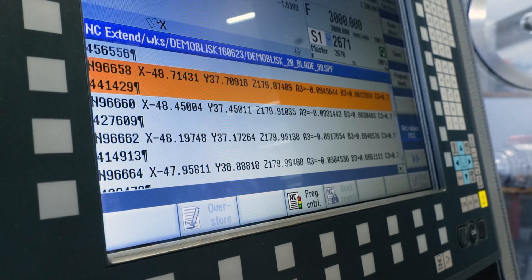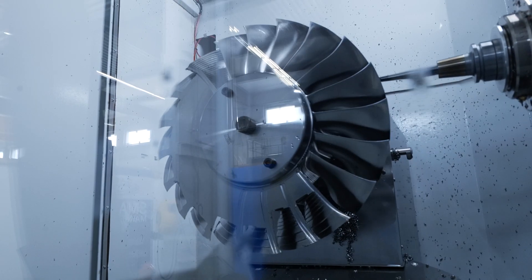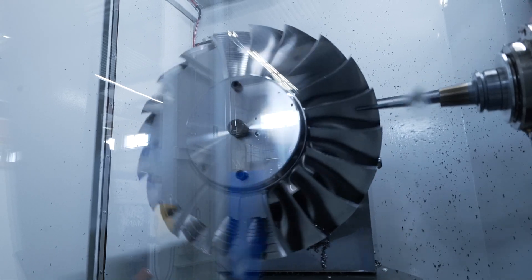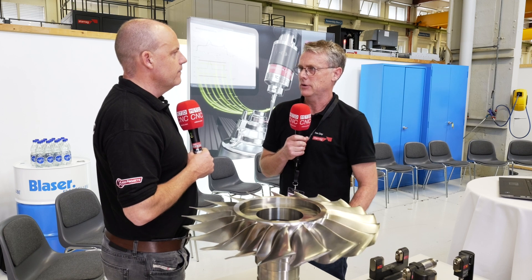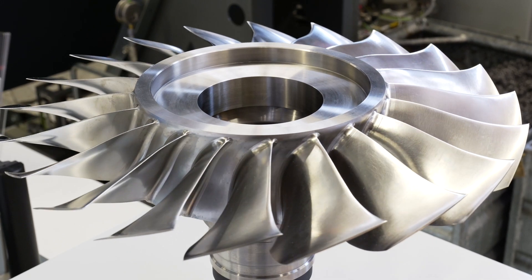So how do you go about that — what do you have to put in place, what do you use? We have to understand a lot of force levels, what the cutting forces are, what the static deflections are, and then we also have to interpret the dynamic frequencies of the freestanding blade as we machine it. In combination, we do a lot of tap testing before on the solid parts, we do tap testing in process on the first few blades to understand what the semi-finished blade frequencies are, sound recordings, DAQ analysis, and frequency adjustments of cutting parameters.